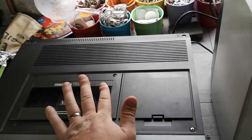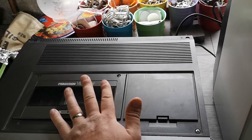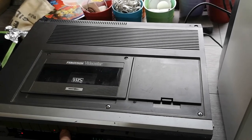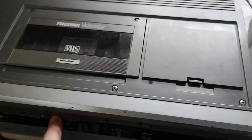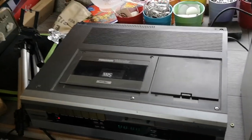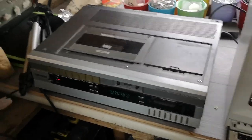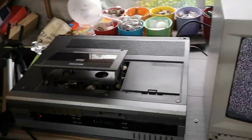I would have thought that because you have the audio heads and control heads after the video head, if it wasn't going to maintain tension it would have upset the audio as well — interesting. However, on the whole I would call this a bit of a win. We've managed to certainly rejuvenate it — it's actually doing better than it was. Although that picture is still dead, we'll try another tape again and see if it comes back. But for the moment, that's all we're going to be doing with this one. Hope you got something out of this — don't forget to hit the like button, subscribe, and I'll see you again very soon.